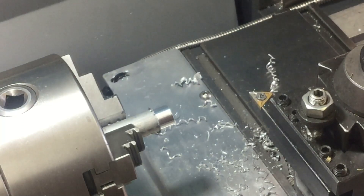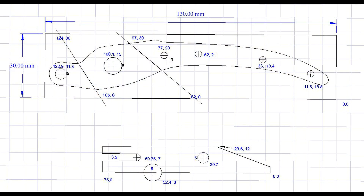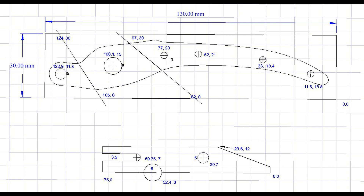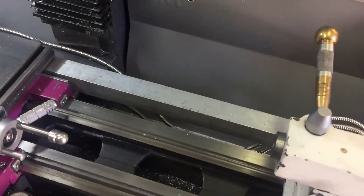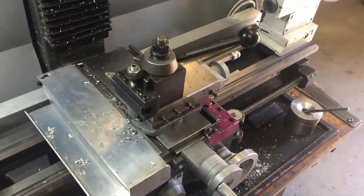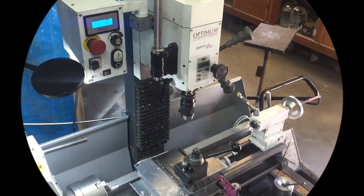So now it's time for the first project — I'm going to attempt to make some parallel pliers. I've drawn everything with a zero point to start with, so once I set that point on the DRO I should just be able to navigate to all the other points that I need to drill and mill. Using the DRO looks to be pretty easy; installing it, not so much — particularly on my little lathe mill combo. But after a number of days of farting around I finally did manage to install it, and I'm looking forward to a more precise building experience in the future.